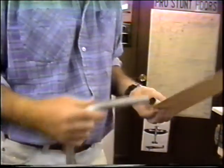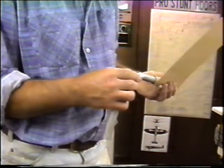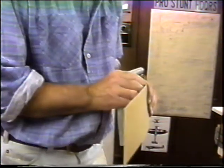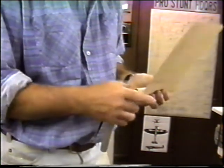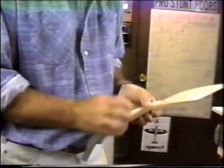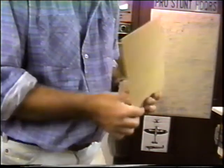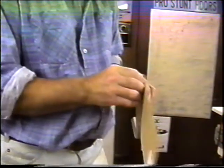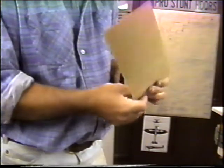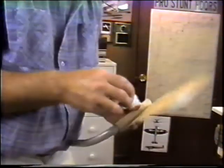Now actually, this piece of plywood is so flexible. This is a 5/8 piece of tubing, and I want to make it just a little oversized that I don't even need the tube to wrap it around. I thought I'd need the tube. In fact, a lot of times, if you don't have a good piece of plywood, you have to soak it with ammonia. This is not going to even require soaking with ammonia. Pretty nifty. Now, I've rolled that up. I'll leave the tube in there for now. Just run a little bit of CA down there.